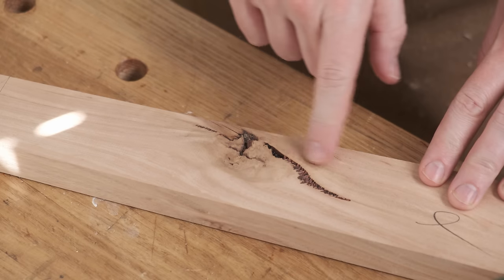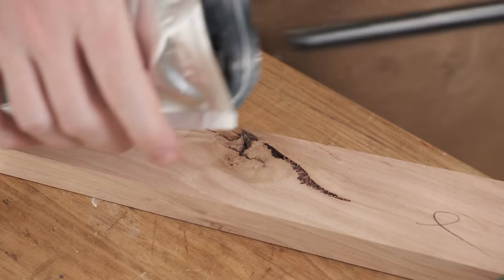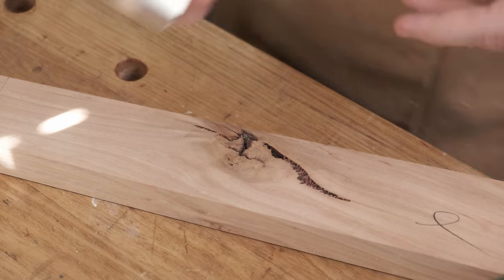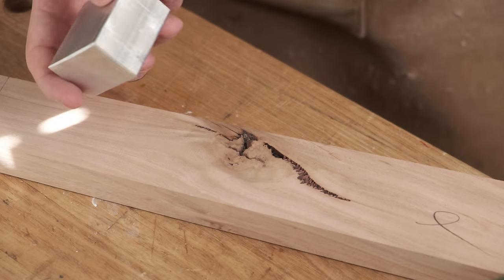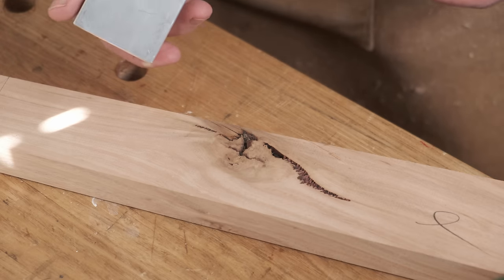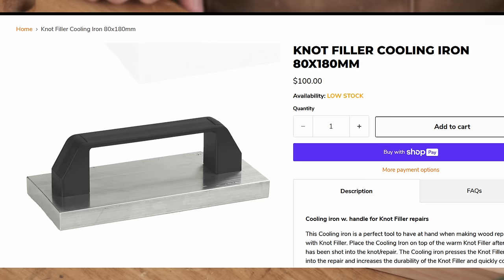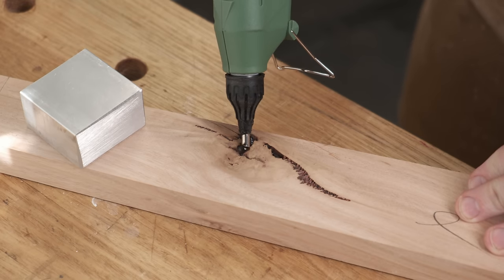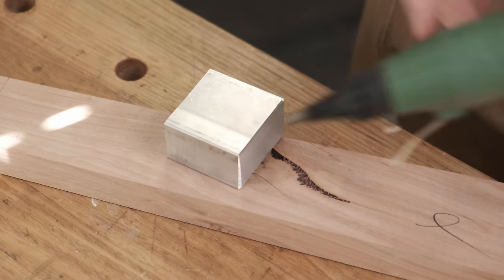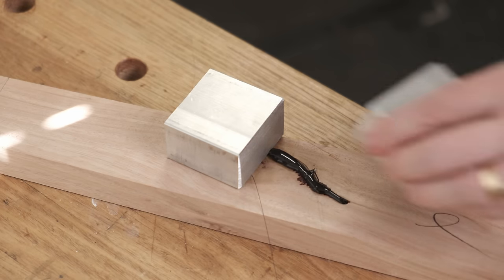So this is the void we're working with — a bit of a knot and sap vein all in one. I'm going to use a black filler stick already loaded into the gun, but they come in resealable foil bags to keep them fresh. The other thing we'll need is this heatsink — it's a block of aluminium. Don't buy it from the company that sells these because they're very overpriced for literally a block of aluminium. Go to a scrap metal place and get an offcut. So we just squirt that in where we need it, plonk on the aluminium, and fill up the rest of it.